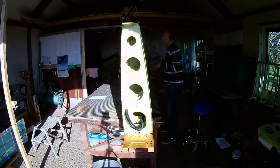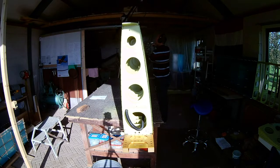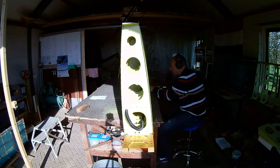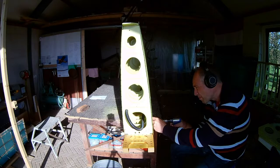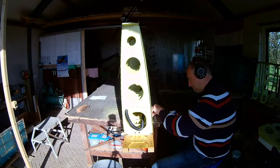The material is thick enough. It's not as thick as the front spar, the main spar. That's why you dimple it and then countersink it. In this session I also primed the leading edges — not the tank leading edges of course, but the other leading edges of the wings.